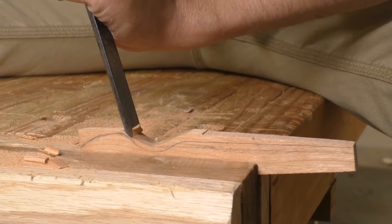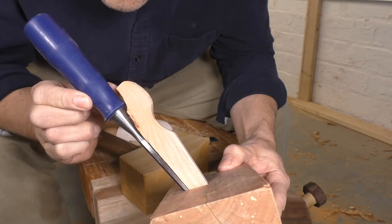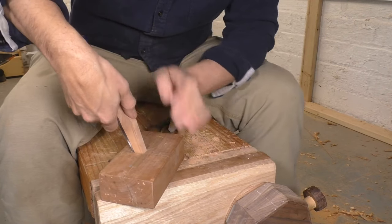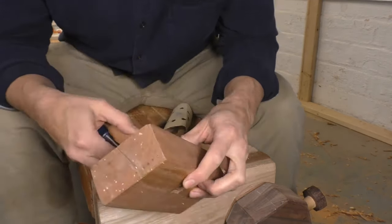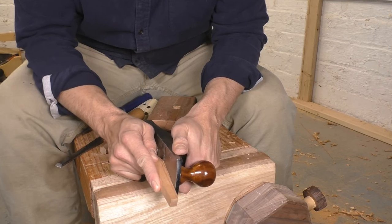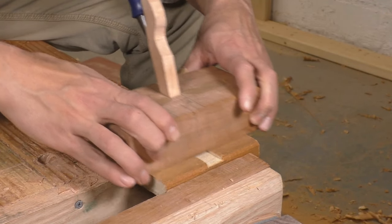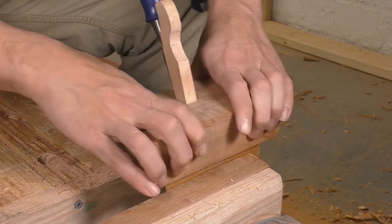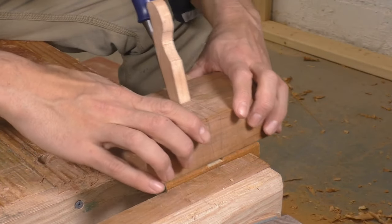The tricky part is getting a good fit with your plane. The handle of your chisel is definitely going to interfere with the back of your wedge, and you'll need to scoop out some material there. Once the chisel and the wedge are working together, tap on the back of your chisel and see if it will come out the mouth. Mine won't, but that's a good thing — my wedge is oversized and I've got lots of wiggle room for slowly adjusting the fit until the blade will come out the bottom. Once you have a little bit of blade sticking out, stop and test the tool. I've made a little test dado in this block and it has a very rough bottom — even though my little plane is only half done, it makes cross-grain shavings easily and quickly cleans up the bottom of the joint. The tool works, and I can move on to shaping.